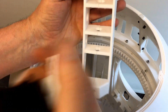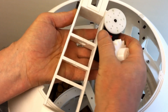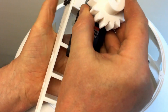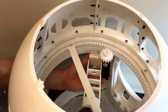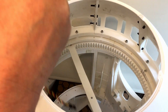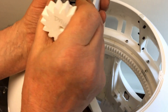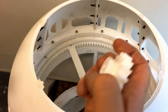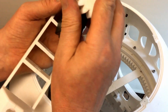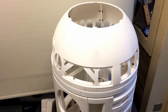The next thing I'm going to do is modify or reprint this bracket to take a large servo — or I might be able to fit it on the side somehow and mount it on top, sitting like that. I may just need to cut out the middle bit and make an insert for it to sit inside here. The dome certainly rotates smoothly enough to give me faith that the servo will be able to rotate it without any additional gearing, because it's a very powerful servo.